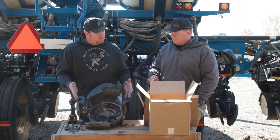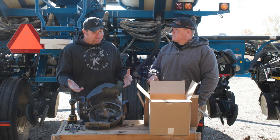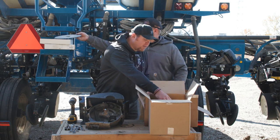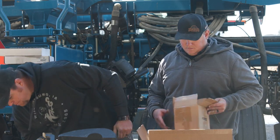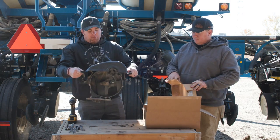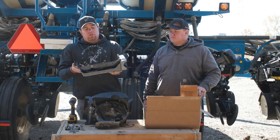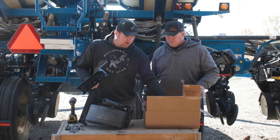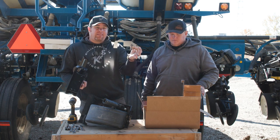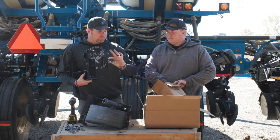Really most of the components are going to be replaced as part of the kit. We're working on a bulk fill machine — if you had a standard hopper machine it would include a new hopper in the kit. The update kit as a whole comes with everything you need to do the conversion. What comes in the kit: the entire true rate meter assembly, a whole bunch of hardware and components, a new pop-metal style meter holder that the meter rides on, a new diffuser, a shim plate that goes between the meter and meter holder, and a meter support bracket to support the new true rate meter.